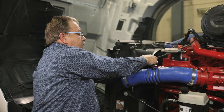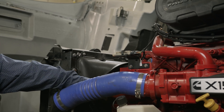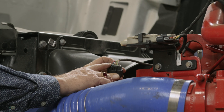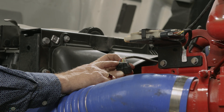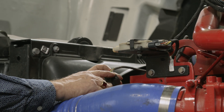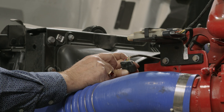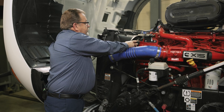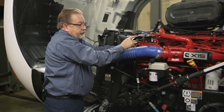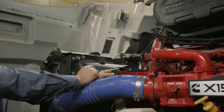If you have a red and yellow LED light, you'll want to remove the adapter harness and do a resistance check on the fan drive. This is the fan clutch lead going from inside the fan clutch up to the DI controller. We have five wires: a red wire and a blue wire, which are the power and ground that control the valve inside the fan drive. We also have a pink with a black stripe and a green, which power the Hall effect sensor in the fan drive that monitors fan speed. And then we have the fifth wire, which is a yellow wire, which is the fan speed feedback. The fan drive feeds the speed back into the ECM and the ECM knows how fast the fan drive needs to operate, controlling current to the red wire and ground to the blue wire to control the fan speed.